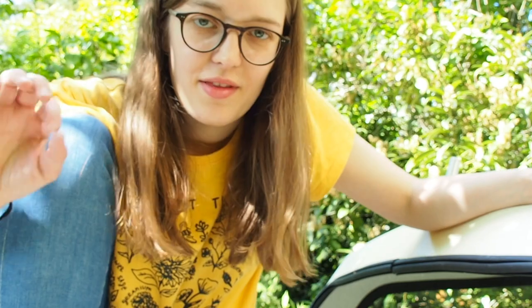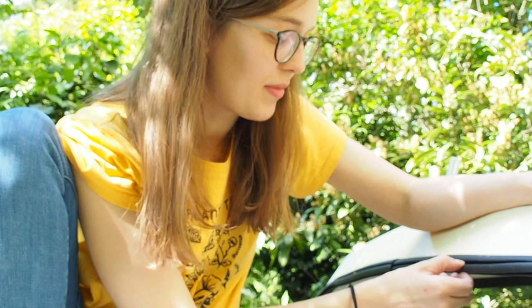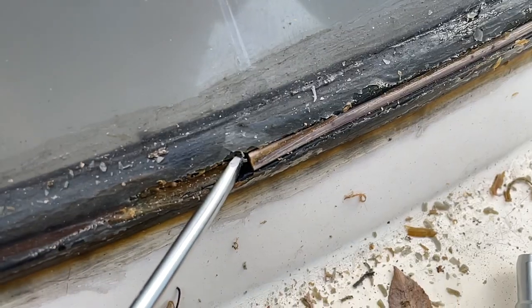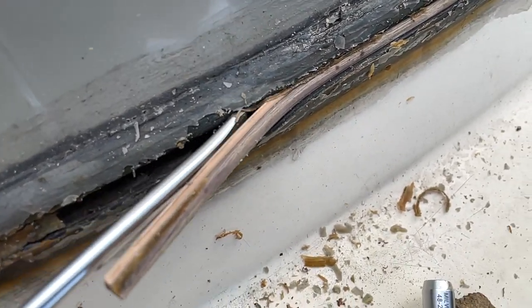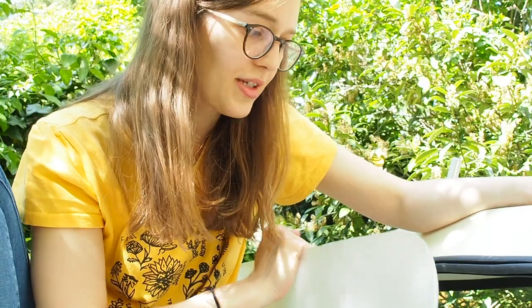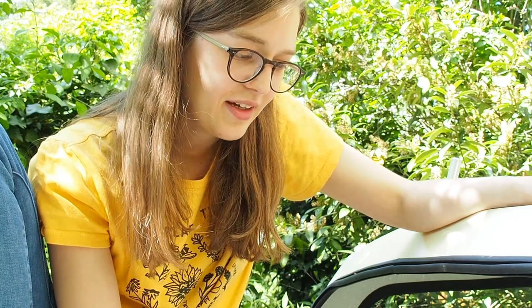As you saw, that was really easy. There's one step that comes before this one, which is removing the filler strip that is right in here, usually right across from where the rubber seal is cut. That's where the filler strip is cut, and that's where you can get in with a screwdriver or a glazing tool like this and just pry it open. Remove it — that should be super simple, you just pull it out. You got the first step done, which is the easiest. Now we're gonna go cut the new one and try again with the fitting windowpane.